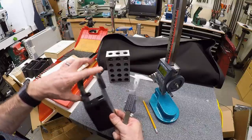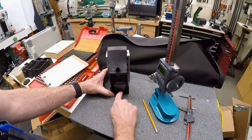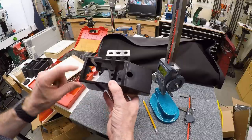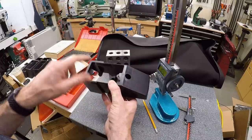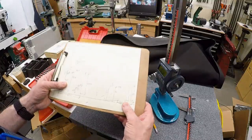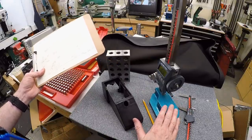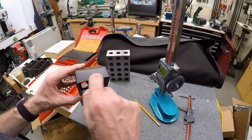The exact position doesn't matter because we'll decide where we want it on the new part, but the opening can easily be measured with calipers. For the screw hole positions, I find pins that fit, then measure the height of the base of the opening, the height of the top of the pin, and get those dimensions. One thing to note: the distance between the screw hole at the top of the opening and the one at the bottom are different — it's not symmetric. I'll leave everything set up so I can come back for any missed measurements.